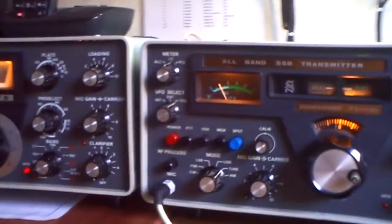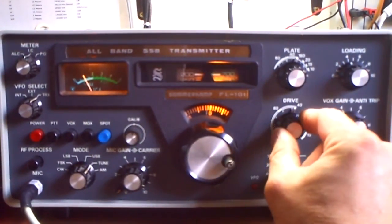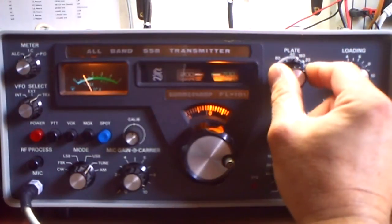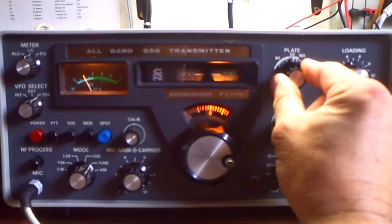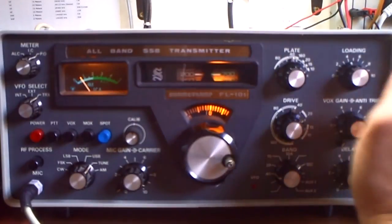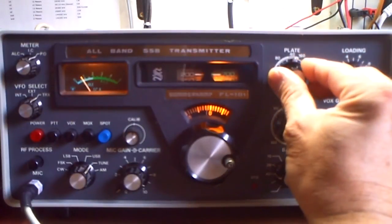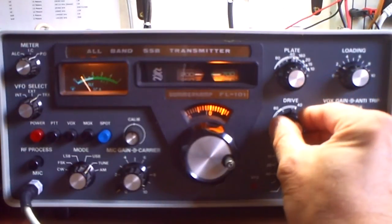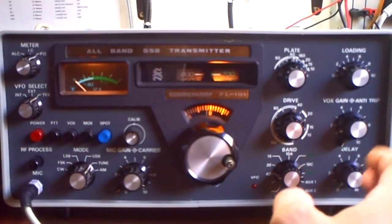Maybe it's better to go there so you can see the whole machine and the meter. So I search here for the maximum. The driver is now selected, then I search here for the anode dip — here it is. So then I can switch on power, go a little bit higher, then I find that place where the power is maximum.